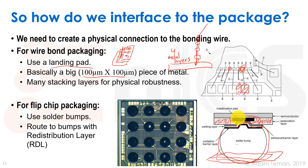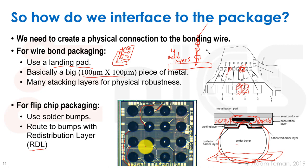To get to the bumps, an extra top layer — usually aluminum — called the RDL or redistribution layer is used. As visible in this small flip chip example, these unusual routes go from the top layer via a via to the RDL and connect to different bump openings.